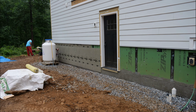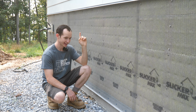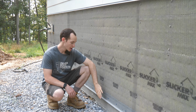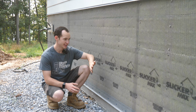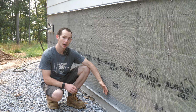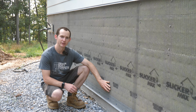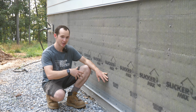We posted a reel about our stone veneer prep on Instagram, and one thing we caught a lot of flak for in the comments was putting this weep screed over top of the drainage mat. The typical spec for this is another layer of house wrap on top of the existing house wrap and putting the weep screed up underneath that second layer of house wrap, maybe even up under the first two. I'm not quite sure because I've never done it. But we did not choose to do this just on a whim.